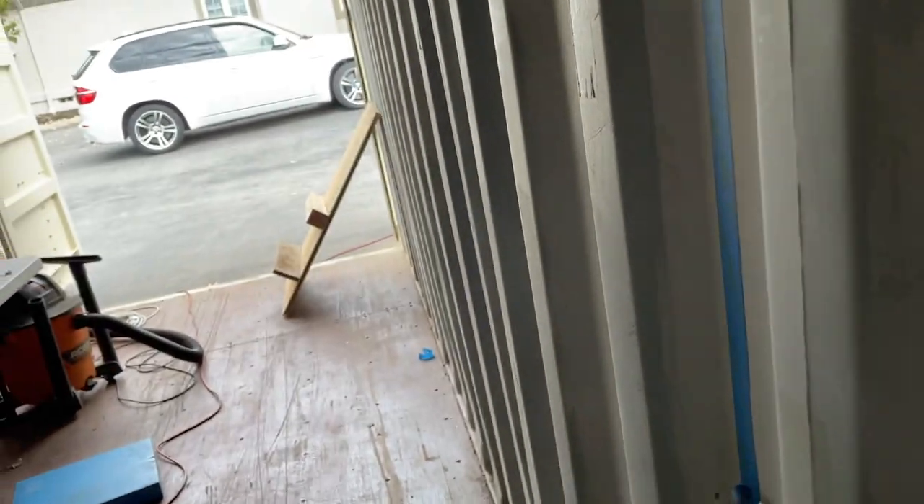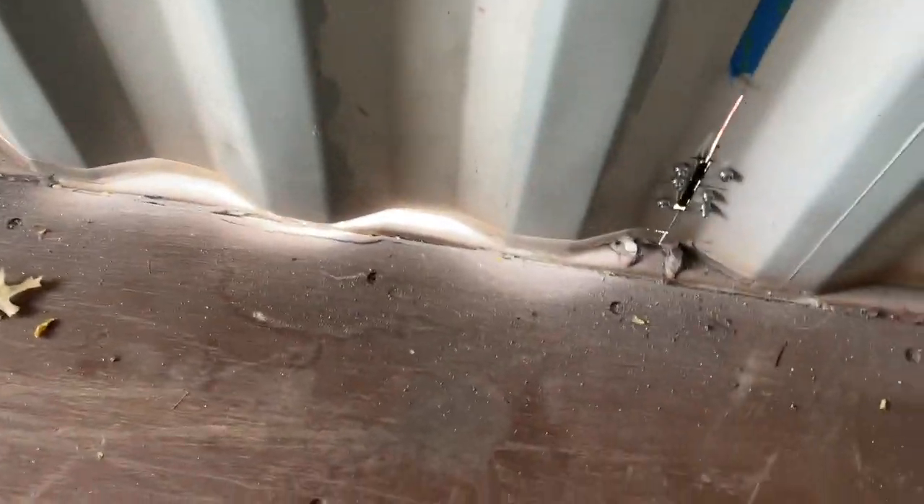Perfect example of what's going on here — this thing is dented all over the place, which means it's structurally compromised. The whole wall actually goes in because it's dented from the outside. I cut one line all the way across and it's all over the place. So I decided to go ahead and start cutting the vertical, and sure enough, it pinches right there, then gets wide again because this stuff isn't perfectly even. It's binding right here, so I'm going to cut the rest of the way down and finish the middle part, which I think is going to be my pinch point.